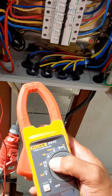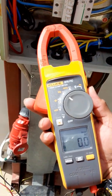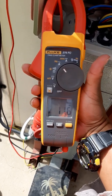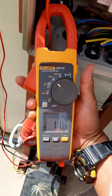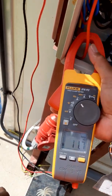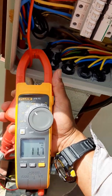Now, amperes. You can use the clamp directly on the cable to take ampere readings. You hold here and press — like this — and you have a reading. This reads 11.6 amperes for the AC supply. This reading is 11.7 amperes for the load in our AC. Maybe it's a 3 horsepower load or so, because we're testing here in the main panel. We can also test outside.